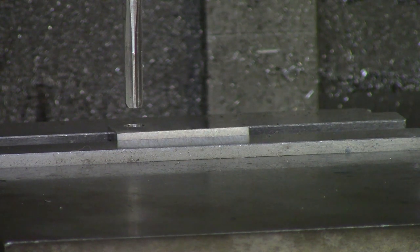You don't want to have too much material. I like to leave 5 to 8 thou a side and slow your reamer way down. So if you're drilling at 1000 spindle speed, you want to slow it down to 350 to 400 — you're going to go a lot slower with your spindle when it comes to reaming. You also want to use oil so that you can have a better finish and it'll keep your tool sharp.